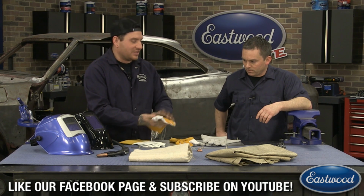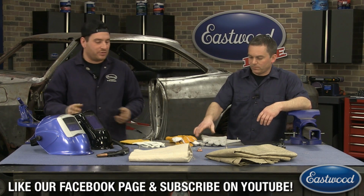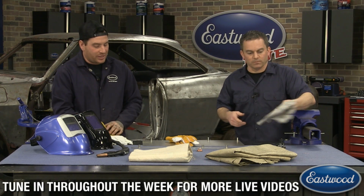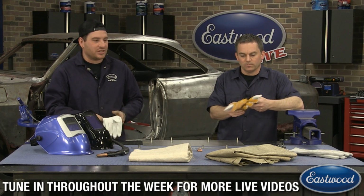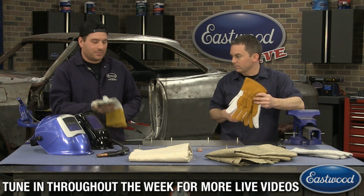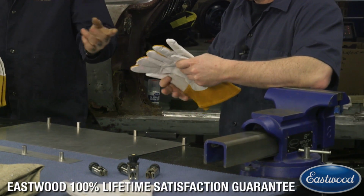In this area, because that's where it's going to see all your sparks. So I pick a glove that's as thin as possible for the job I'm doing because I like the dexterity. But of course, if you're just doing stitch welding on sheet metal, you could probably get away with TIG gloves. But if you're doing any kind of heavy fabrication, you need something like that.